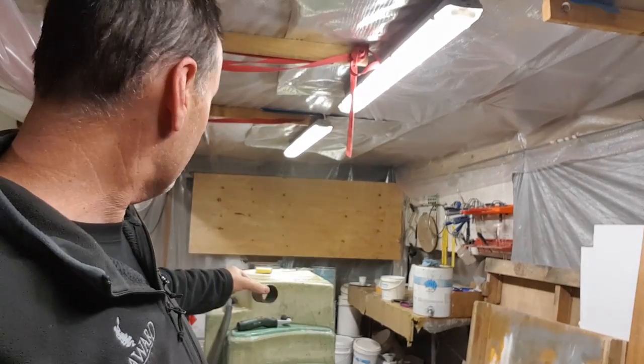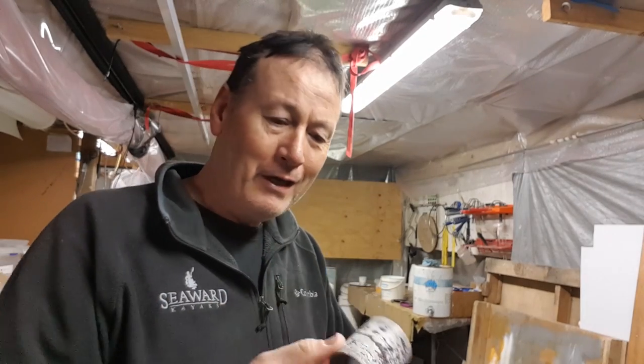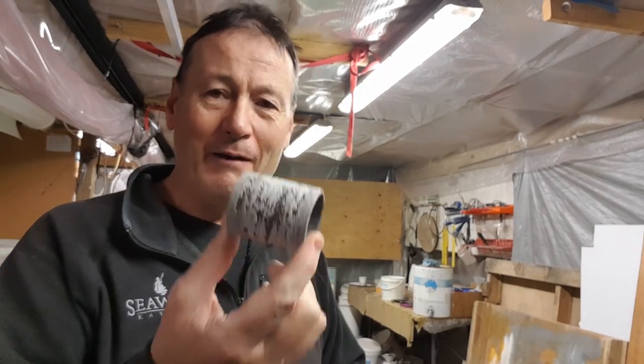Okay, so I just want to highlight something. I just sanded that top stair tread for 2 minutes with my roller sander, and obviously there's a lot of heat and a lot of friction going on, and because the laminate's still green, which means that it's still in sort of a tacky stage, I guess. It looks like it's set, feels like it's set, still a bit tacky.